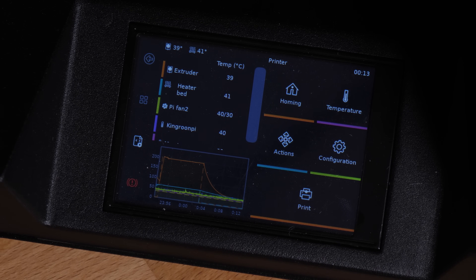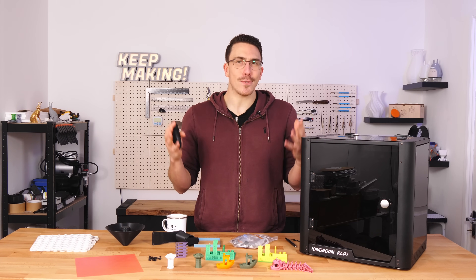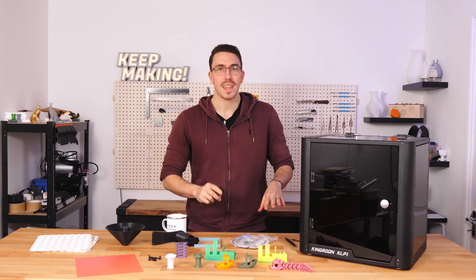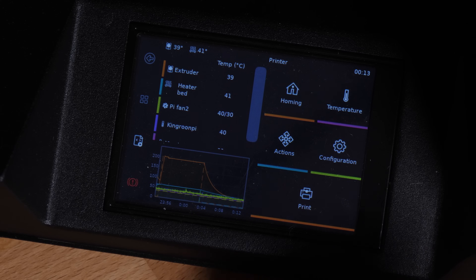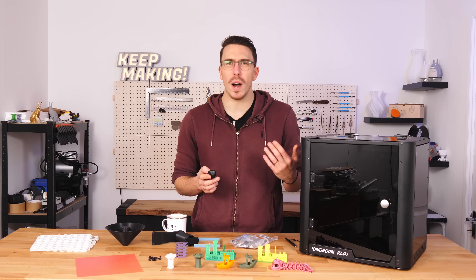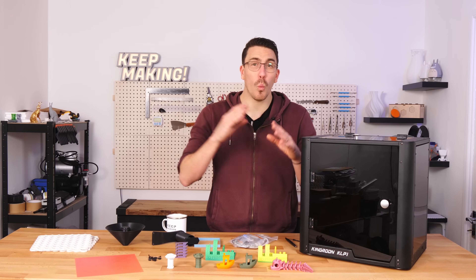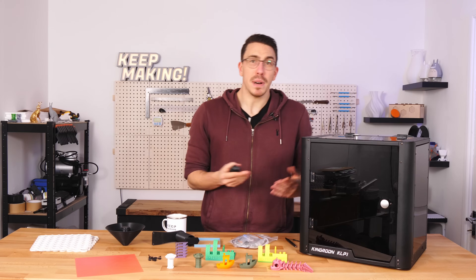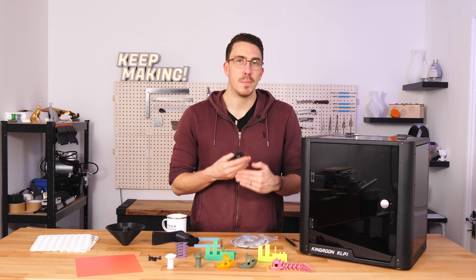When printing PLA with the door open, it's another 300mm out. It has a 3.5-inch touchscreen, and that's where we start the part of the review where I point out the questionable design decisions. It's a 3.5-inch full color resistive touchscreen. Don't get me wrong, it's great to have a full color screen with a nice resolution, but why is it resistive? That means it will eventually degrade and it has one of the worst possible viewing angles, nearly impossible to see in sunlight.